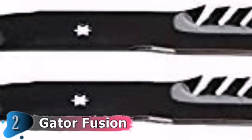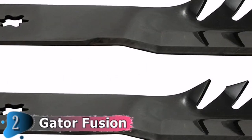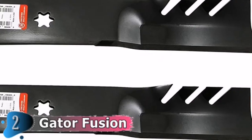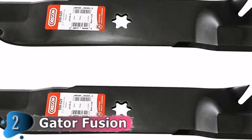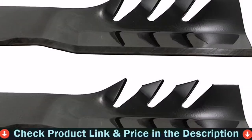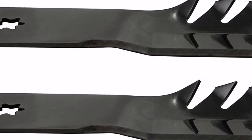With just about 0.164 inches thickness, the mounting hole of the blade can fit a six-point star machine mount. These blades are made out of tungsten carbide fused towards the edge, and thus boast a superior and longer lifetime. Check to make sure the blades you are replacing have a six-point star mounting hole — if they do not, these blades will not fit.